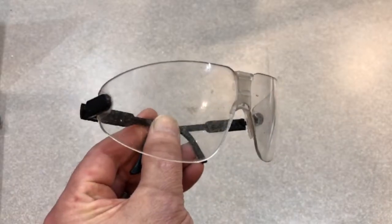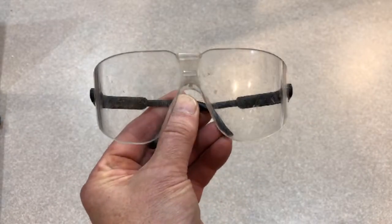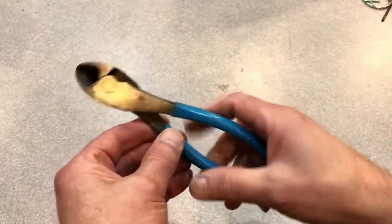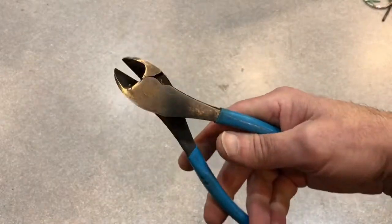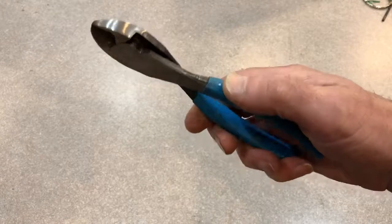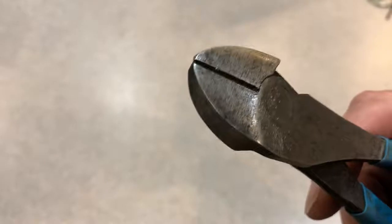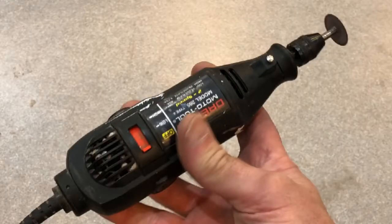Safety first. Always wear safety glasses when working around spring wire. The ends are incredibly sharp and it could go into your eye and it would really ruin your day. To cut spring wire, you'll need a quality pair of wire cutters — these cost about $25. You'll notice that the jaws have no nicks or dings from cutting spring wire. When cutting spring wire, always make sure the wire is pointed away from you. That little cutoff piece flew about 20 feet in my shop. You can also use a Dremel tool with a cutoff wheel to cut larger diameter spring wire.